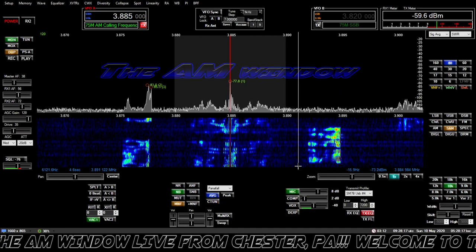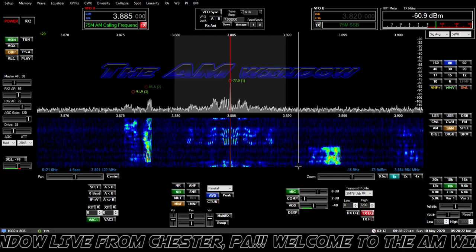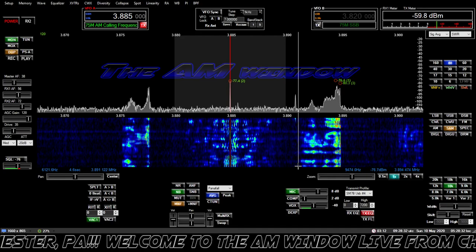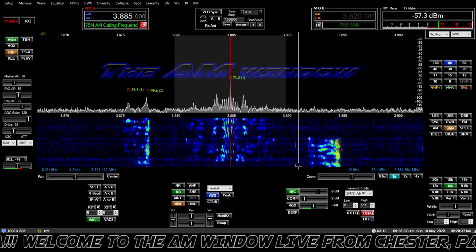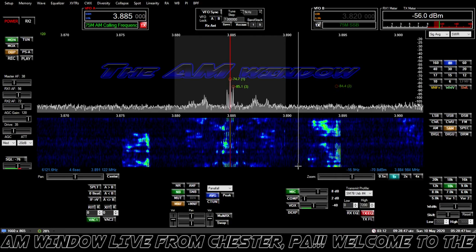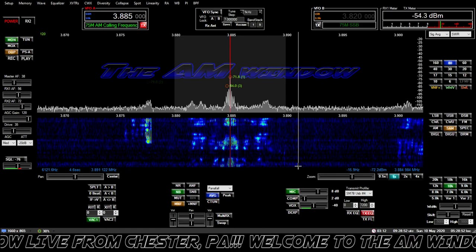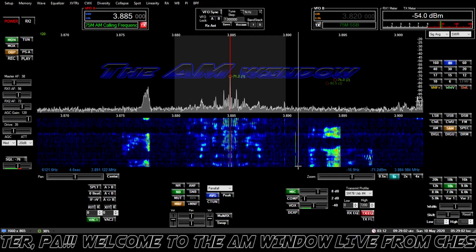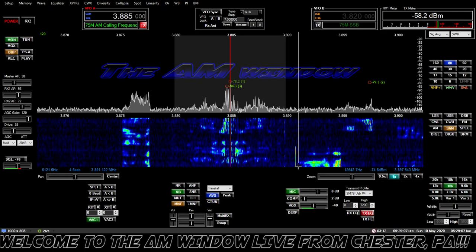And I've been firing up antennas and everything else on the 10 meter band around here. And that was the exact reason I had put up my log periodic. I had just a standard Yagi up for 10. My dad had given me, when I got in from the military, a Wilson Shooting Star that he used on 11 meters years and years ago. And he gave me the entire antenna. It was just laid in a pile in his backyard there, so I grabbed it up and I made a four element monoband 10 meter Yagi out of it.